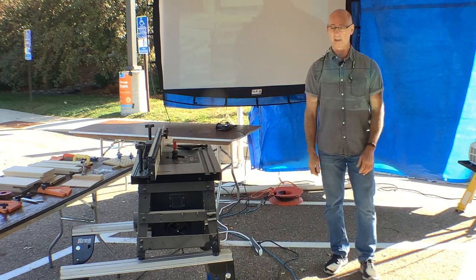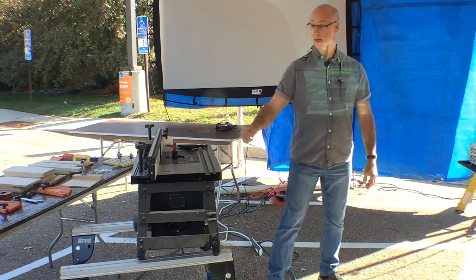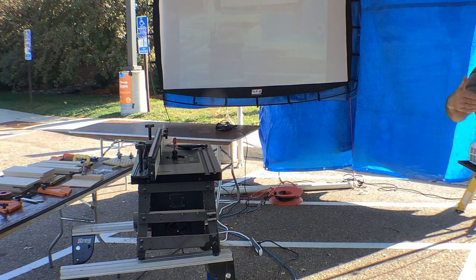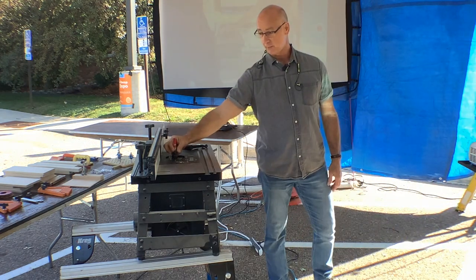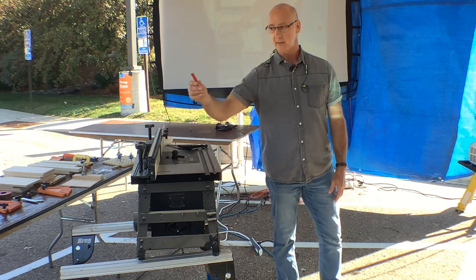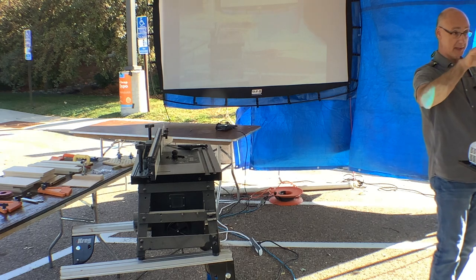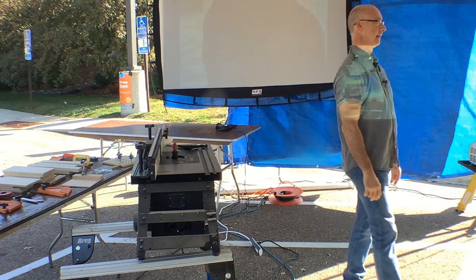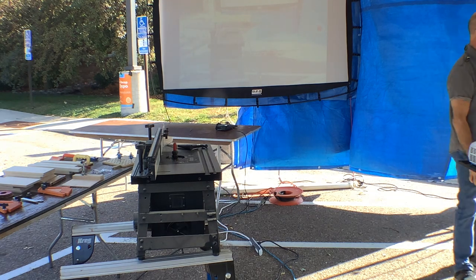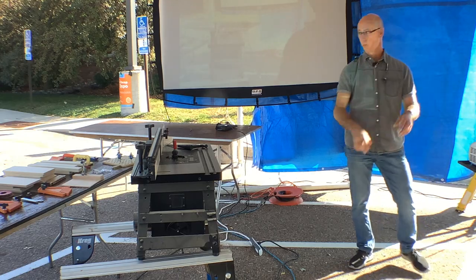So let's start with a little lesson right there, which is I'm putting the router bit in. And what we want to do is not put the router bit all the way in, and I'll talk about why not. And we also want to not put it in far enough. General rule of thumb is 2/3 of that shank should be in the collet. So this is a fairly obvious accident waiting to happen. If I'm not grabbing enough of that shank, there's an opportunity for that bit to come loose. We don't want that. If I go all the way in, if you look really closely at a router bit, commonly where the shank of the bit meets the body of the bit, there's a little fillet right there. There's an inside corner. And if we just do that, there's a chance that that collet is now trying to grab that oversized fillet instead of the nicely machined shank of the router bit, which can lead to the collet coming loose. So it's fine to do this, then back out just a little bit, just to get away from that weird diameter.